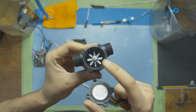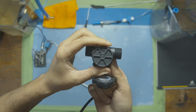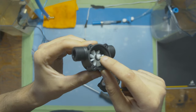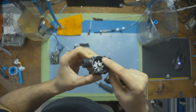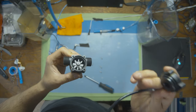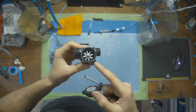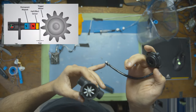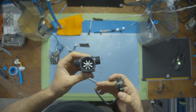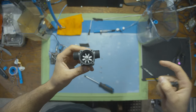When we open it up we can see there's an impeller inside that spins around and counts. On the back it has in and out labels telling you which way water flows. On top of the impeller there's a black piece which is actually a magnet. To count how many spins the impeller makes we use something called a hall sensor — it detects the magnetic field every time the magnet comes around. That detection is converted into an electrical signal sent out through the cable to our board every time it makes a full spin, allowing us to accurately measure the volume of water flowing through the pipe.